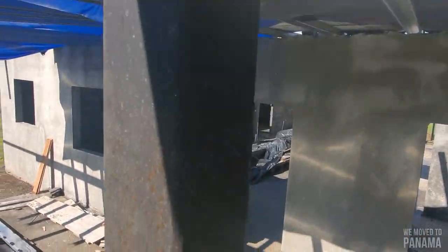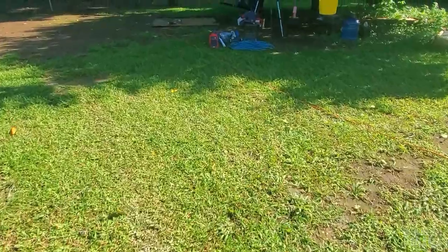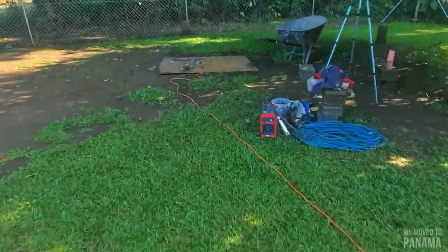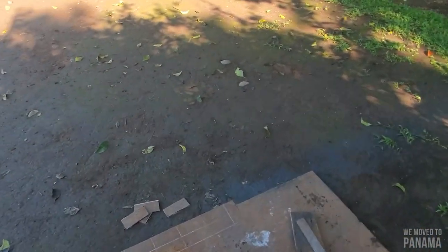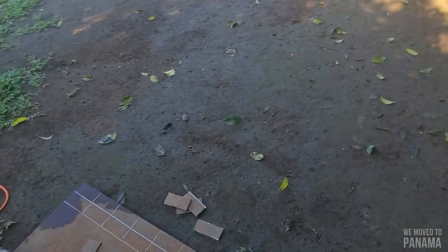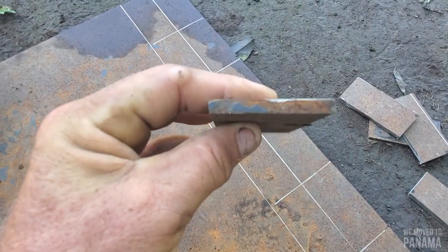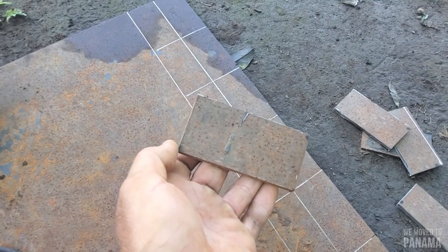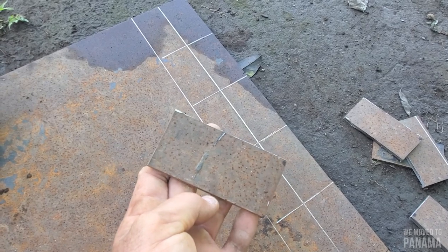As I've been cutting it I must do it on both sides — front and back. I have to make 16 of them altogether, and then I'm going to add triangles I've made out of the same metal, 5mm thick. I'll make them 5cm by 10cm — it can be 5x5 but I'm making them a little bit longer.